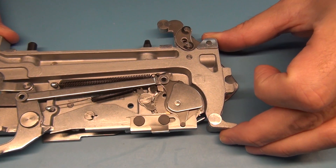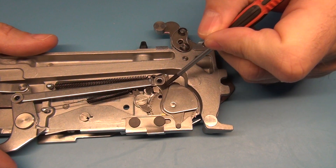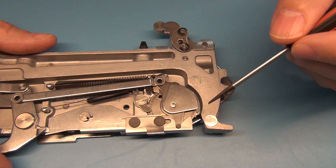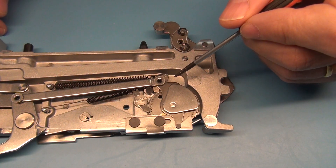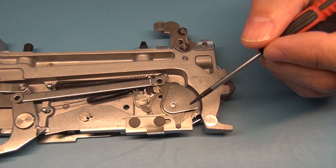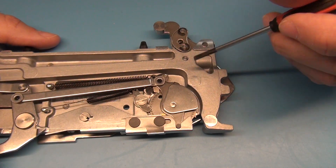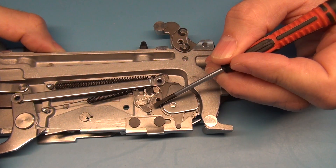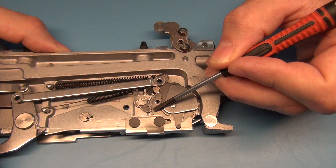So what is the problem with it? The problem is that this wheel here with the pegs that feed into the paper tape or plastic tape — this wheel will actually move slightly backwards when the feeder is actuated via the pneumatic actuator. You can see this when I try to activate it manually. This wheel moves ever so slightly backwards when I move the tape forward a bit.